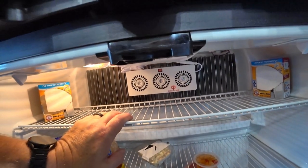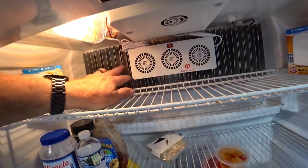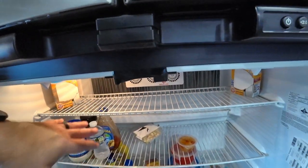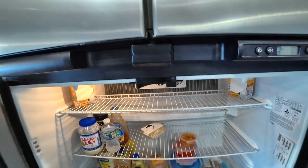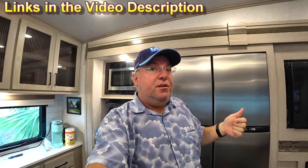On our Dometic and other refrigerators we've had in the past, the single ones with fins in the back — that was the first thing that frosted up. Now on this big refrigerator with all these fans, the frost situation mainly happens in the freezer, as you can see up above. The links are in the description. Make your decision, have it shipped to you, do the wiring — you've got to know how to do wiring, it's not difficult, and if you want to learn DIY projects this is an easy way to learn. Run your wiring to your fans and you should be able to go a lot longer before you have to defrost your refrigerator. As always guys, we hope to see you out here. Bye!